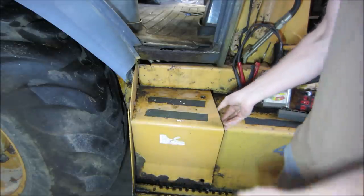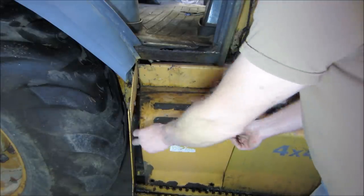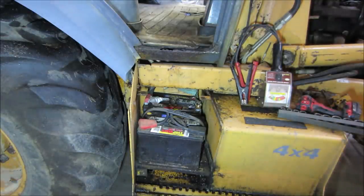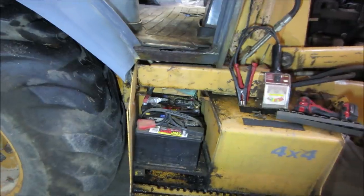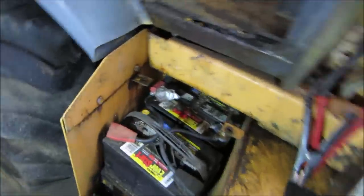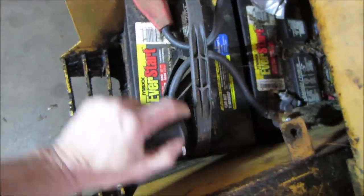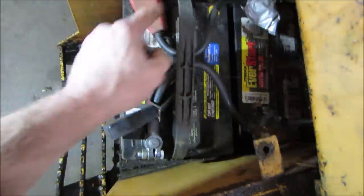You think one or two? I'm gonna see. Looks like it only has room for one. Two. It's probably a 24 volt system. See how they're tied together? Generally, on a 24 volt, you'll see negative going to positive. So that's a ground. Going to ground. Yeah, so it's 12 volt. They're tied together, and the two hots are tied together.